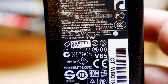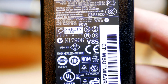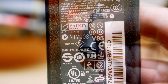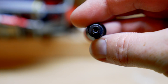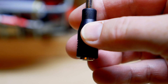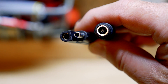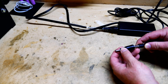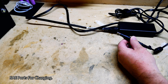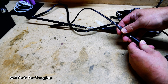Using this power supply only requires a couple of connectors to make it work with my power boxes. It has a 7.4 millimeter male plug. I'm going to use a 7.4 by 5.5 millimeter adapter to convert to the size of 5.5 by 2.5 millimeters, then a 5.5 by 2.5 millimeter DC coax female adapter to go to an SAE type plug. All of my DIY power boxes use SAE plugs and connectors, as this is a very popular connection for lots of DC devices including some 12 volt solar panels.